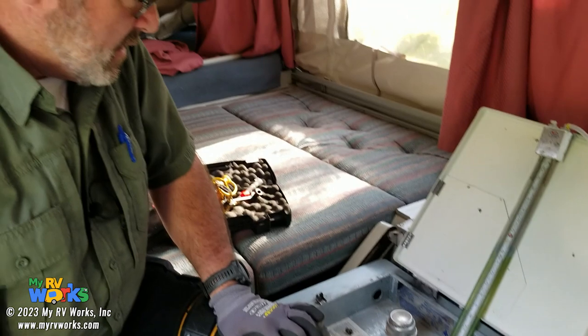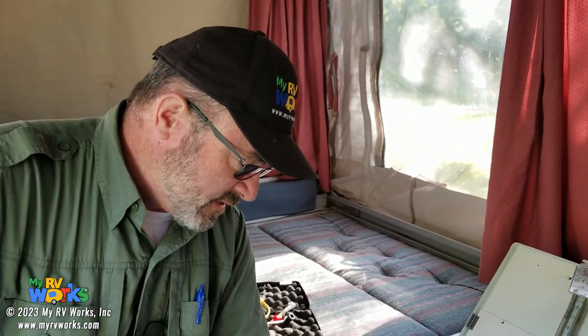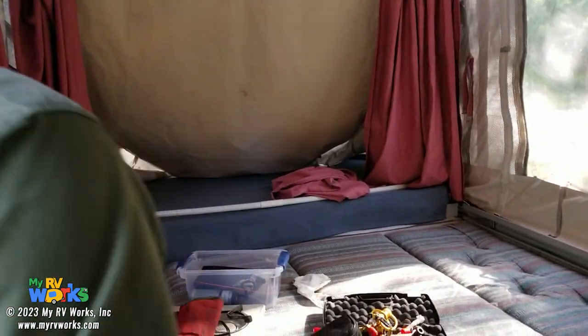So anyway, if you got your slack tube, don't have it at an angle. Hold it up and down. So I'm going to say that the propane's fine. The next thing we would do is check for leaks. The way we check for a leak is I'm going to turn off the cylinder and we're just going to sit here and take some of the pressure off of this. I like to get it around 8. Then we're going to watch to see if the pressure goes up or goes down. I'll just leave it on the digital because it's funner to watch those numbers. So let me go turn the cylinder off.